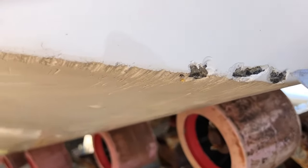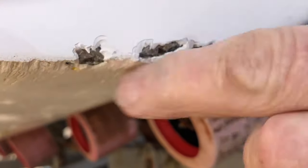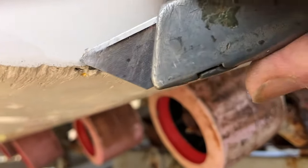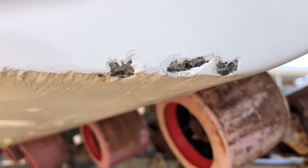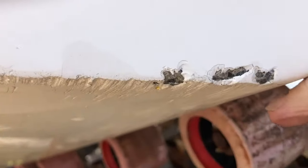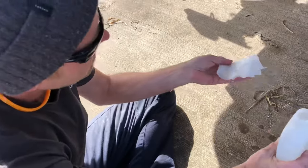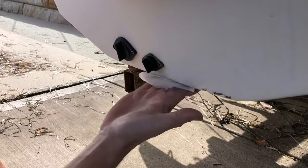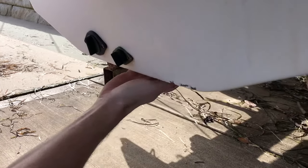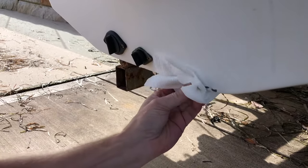The first thing to do is go through and make sure there are no loose bits of gel coat — chips or anything like that. Clean off all the loose bits that are going to fall off anyway. Then we're going to get acetone with a paper towel and clean this whole area before we put some filler in. The reason you use a paper towel is that acetone can break down the plastics in a rag and smear a coat of plastic on, and then your gel coat won't stick. So paper towel is the way to go.